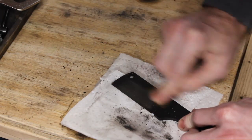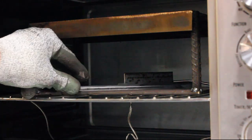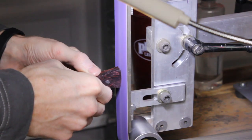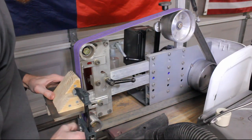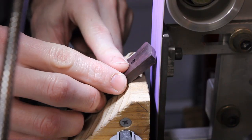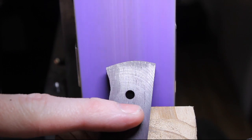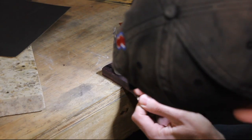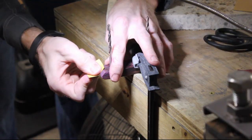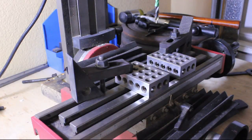File tested — it's nice and hard. I knock off a bunch of scale and then throw it in the tempering oven. I have a cage built to protect the knife from direct heat from the heating elements. The tempering oven is set at 397 and it normally lines out around 393 or 394 degrees Fahrenheit. I feel that's a good starting spot for tempering 1084. You can go up to about 425°F and still have a decently hard and tough knife, but I normally start in the 395 to 400 range.